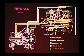Pressurized oil is also directed from the selector spool into the C3 pilot circuit, which is routed through the open C3 retard check ball. The C3 pilot is actuated, permitting pressurized oil from the supply gallery to pass through the pilot and into the C3 clutch. The steering return, reverse lockout, and clutch lubrication circuits are functioning the same as described earlier.